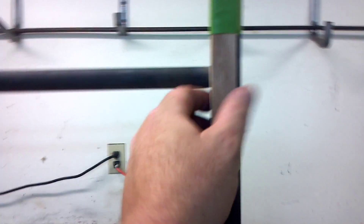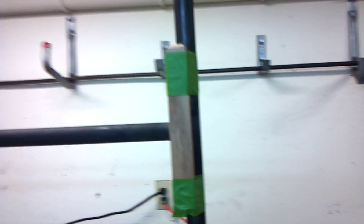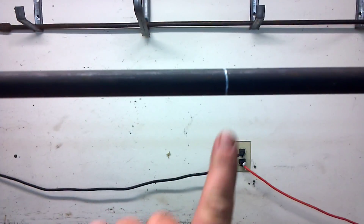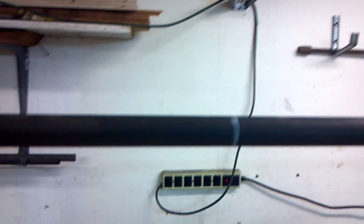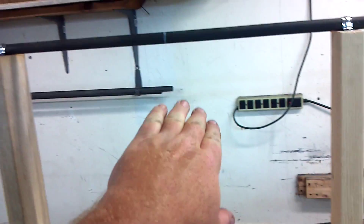Here's where we're at: I tack welded the tail post on, then I took one of my jig blocks and taped it so the center lines up on the tail post center. Because the plans call out from the center, it came out through my first white mark, second white mark — that's my paint marker — and my third. So the intercostal is going to come up here, right to the mark, and back down.